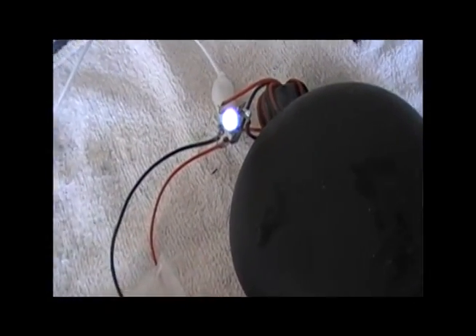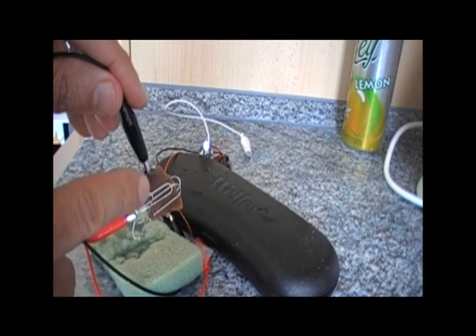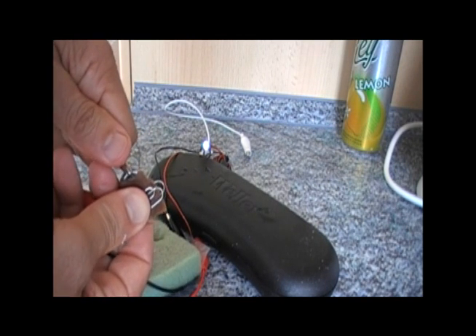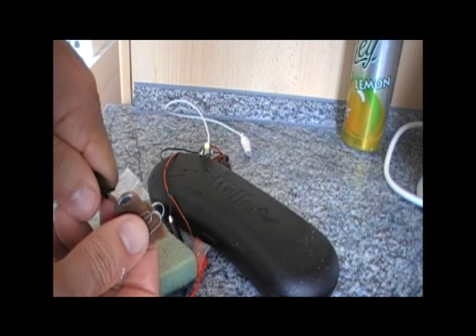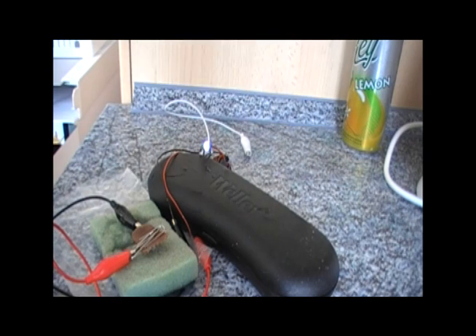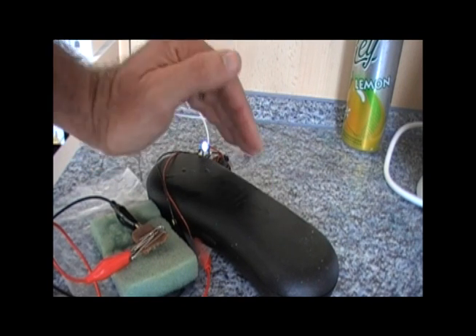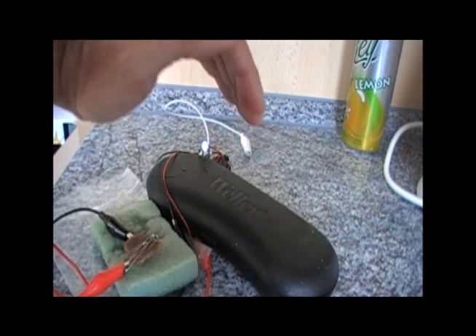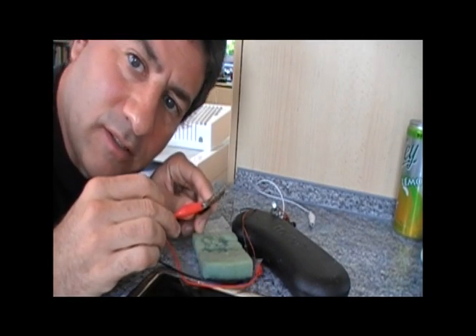That's basically all there is to it. As you can see, it's just a metal tab soaked in a little bit of sodium hydroxide water solution with a bunch of paper clips on the outside, and it works perfectly well. The aluminum is the anode. And that's how we make the simplest of all aluminum oxide batteries — probably the simplest battery that the world has ever seen.